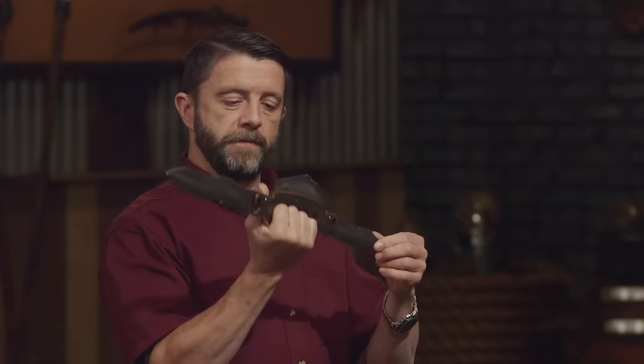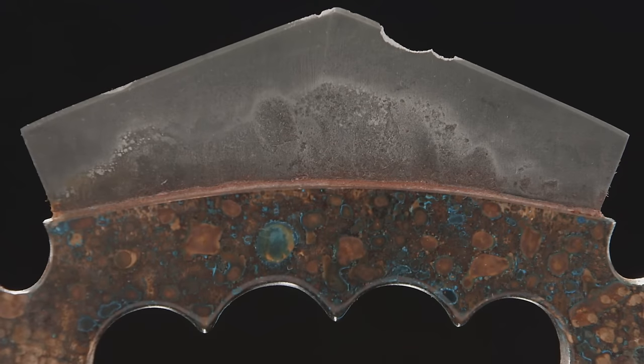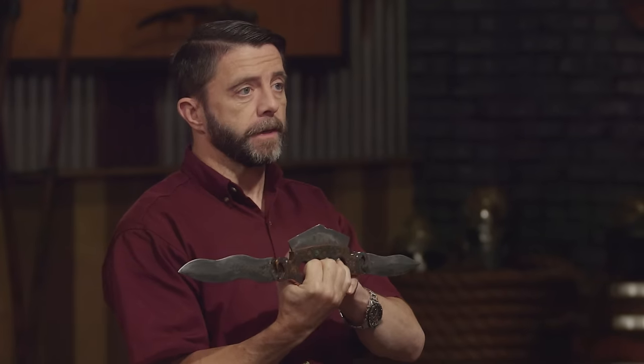All right, Kyle. In this strength test, your two long blades held up great. The center blade here took some chipping on that chain. I'm looking at the grain in there, and it's pretty big. I would have liked to have seen that refined. But in general, these two blades held up well. Nice job. Awesome. Thanks, Ben. All right, Ben, you're up. You ready for this? Sure am.